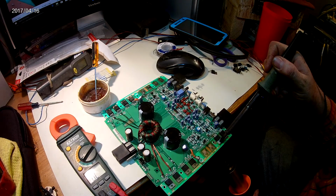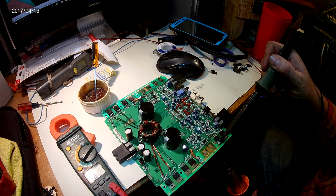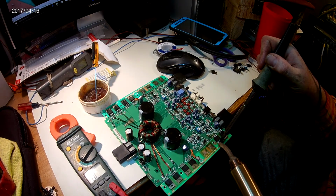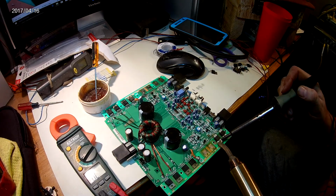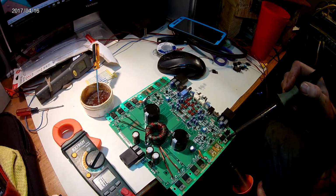Now the flux is activating, and it'll clean the surface of the back of the transistor. And the solder that's on the thermal pad there will become liquid, and then the whole thing will just kind of stick together when it's ready. Soldering iron is just adding extra heat, that's all it's doing. From the top. Come on, there we go.